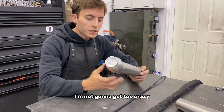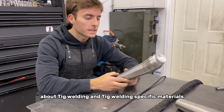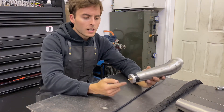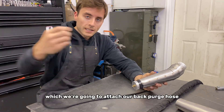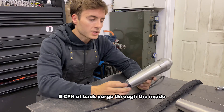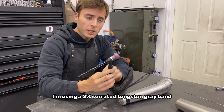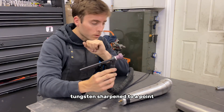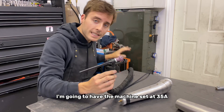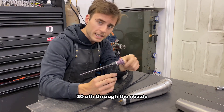Let's finish weld these. I'm not going to get too in-depth with welder settings as I have a lot of other videos on this channel about TIG welding and TIG welding specific materials. When welding these megaphones we're going to back purge them. We've got the tin foil on one end and the back purge puck on this side, which we attach our back purge hose to — that fills the inside of the part with argon. We'll be running about 5 CFH of back purge. We're going to use a number 16 welding cup, a 2% ceriated tungsten sharpened to a point. For this 20 gauge 304 material, I'm going to have the machine set at 35 amps, about 1.2 seconds of pre-flow, 12 seconds of post-flow, and I'll probably be running about 30 CFH through the nozzle.